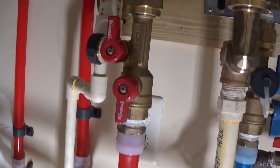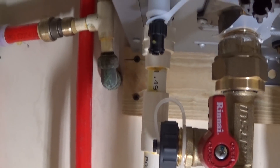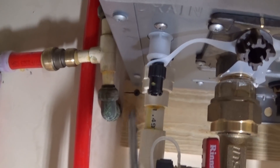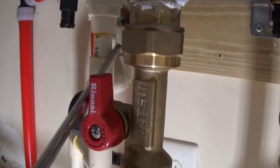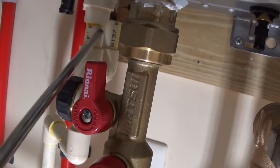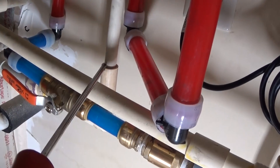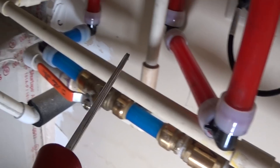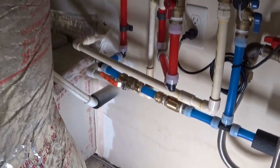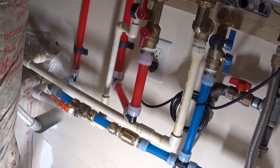Condensate — very important. Can you see the condensate right here? Here you have a female adapter which goes to a T, and we have a vent which vents the line. Follow my screwdriver — it goes down to a three-quarter line, which then goes back to another three-quarter PVC line and that goes down and outside the house. The old unit was also condensing so we just attached to that.